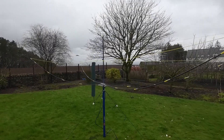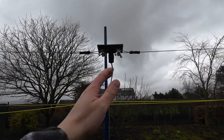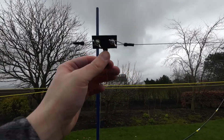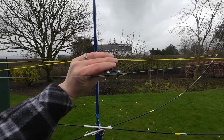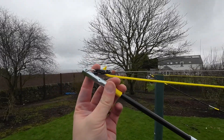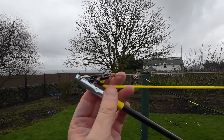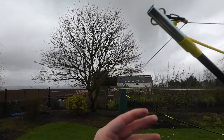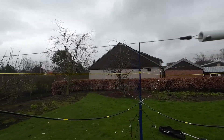I just want to have a little close-up look at the antenna so you can see what I've actually done. Coax coming off that, and it's got some liquid tape there. Across to the ends, you can see there's a lot of metal towards the ends, and I think this is what's probably affecting the SWR a little bit. You can see I've got the pre-tensioner wire there and also the element wire. Here we've got our insulator for the middle — same on both sides.